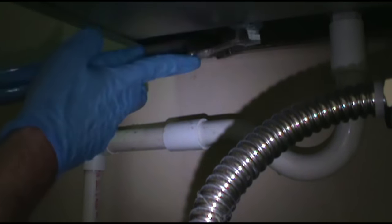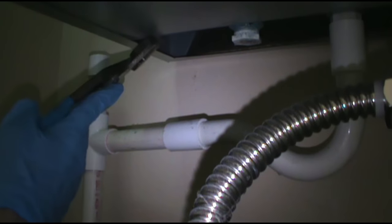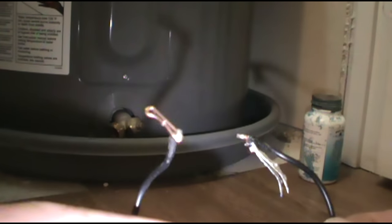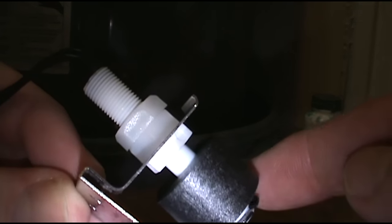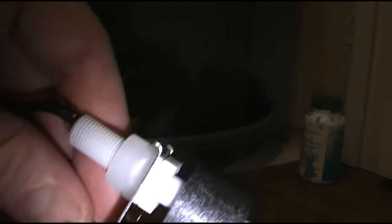I'm not going to film all this - I'm just going to screw this in tight, give it the old water test, make sure it doesn't leak, and then install my float switch. I'll bust open the new one. This is it - just two wires again. I'll clip it off a little bit and strip it. Just clip it on to the drain pan, and if the line gets clogged up the water will rise. It just has to come up a skeeter leg and it'll break that 24-volt connection and shut it down. And that's when the resident calls you saying my AC is not working and you come suck out the line, re-engage the float switch, and you're back in business.